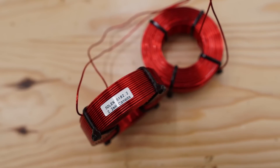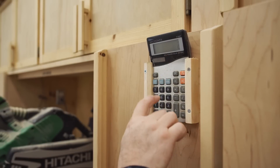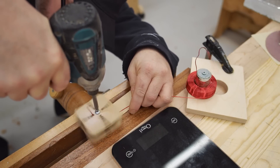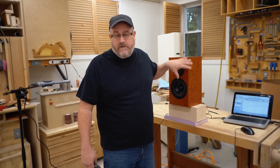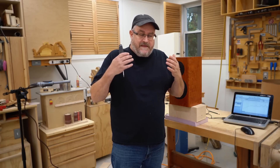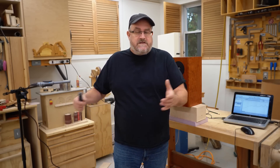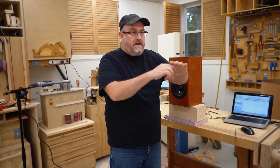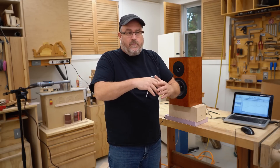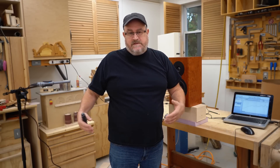The crossover was the big one. I made the crossover by taking inductors I already had, unwinding them and rewinding them, and using weight as the measure to do the actual calculations. The proper way to design a crossover for a speaker is to take both drivers, put them in and do measurements, then you can design the crossover. You can't design a crossover based on the published specifications of the driver — they don't measure the driver that way. What they do is put the woofer in a big infinite baffle, which gives a more accurate representation of the full frequency response without baffle step losses.